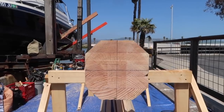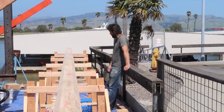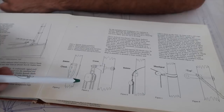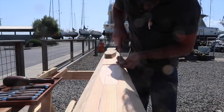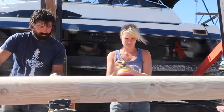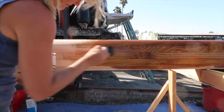We still have a little over a week to go, but already we feel really solid about our decision to build a fresh mast. It's super important at this stage of the build to work on the things you're motivated to work on, because it all has to get done. Up next, we break out the plans and hit the books to begin building the hounds for the mast — where the shrouds wrap all the way around. Then the days finally come to start shaping down the mast, slowly sanding it all round including the masthead, and finally slapping on some finish.